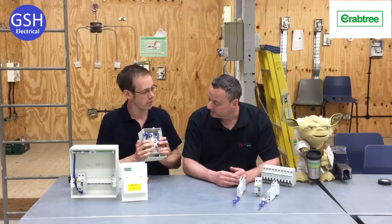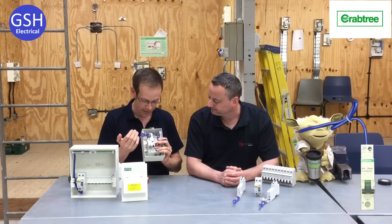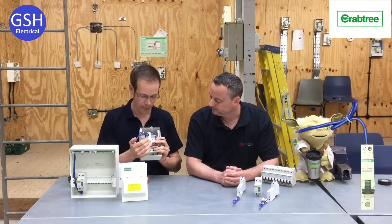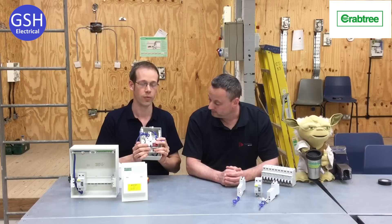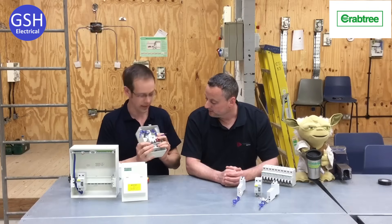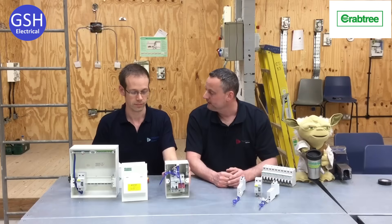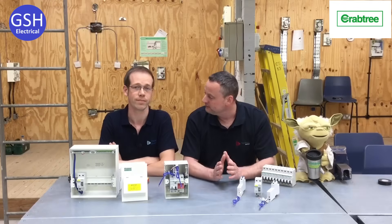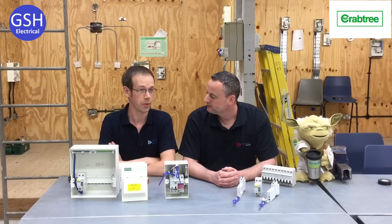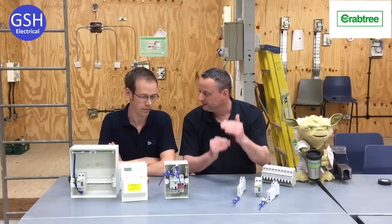It's a fantastic little product — and I know what you're going to ask: surely we're going to be paying through the nose for that? You'd think it would be more expensive because it's smaller, but actually this new RCBO is exactly the same price as the existing RCBO, so there's no cost implication. The range for those RCBOs — where does it go in terms of amp range? I believe it's from 6 amp up to 40 amp.